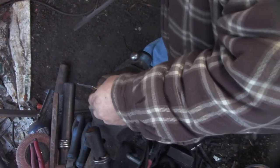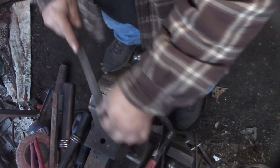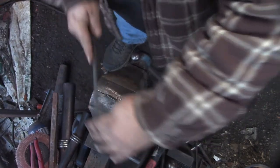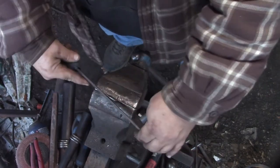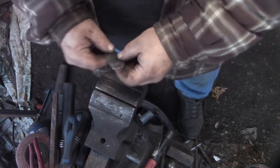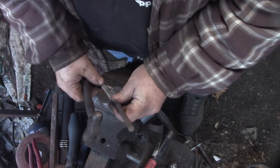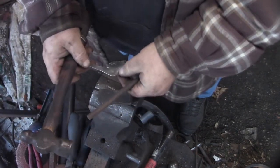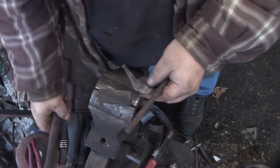That was something I was planning to do before spring gets here, but depending on how long this house takes. I screwed up when I sunk the little bit of foundation for that vise. There's a lot of rock, big rock, underneath that flooring, which is I think sand. Well, now it's a lot of things. So when I dug down and I hit that rock, it wasn't really deep enough, but I thought if I spread it out, that would be okay. And I should have known better, but underneath that rock, I think is a pretty nice bed of clay, at least when we were digging the post holes for that, it was.